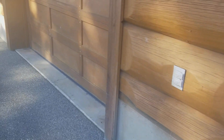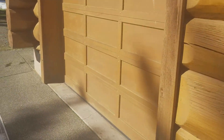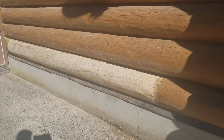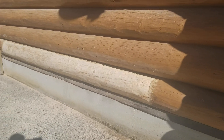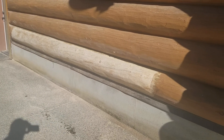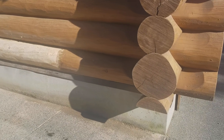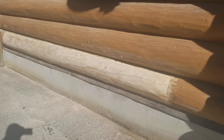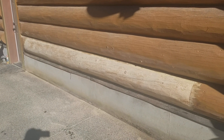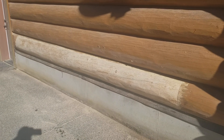Lastly we have another area on the garage wall over here where we had to do another veneer patch. Most of the time it's just many times less expensive to do that than try to replace the entire log, because that log is in good condition. It's just that maybe three or four inches in it's become soft. So we pulled that out and found some dry wood and veneered that back in there with screws and Gorilla Glue and Cobra Rods and borate and all that good stuff.